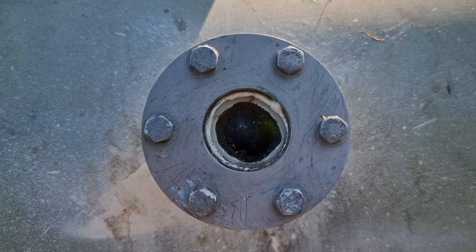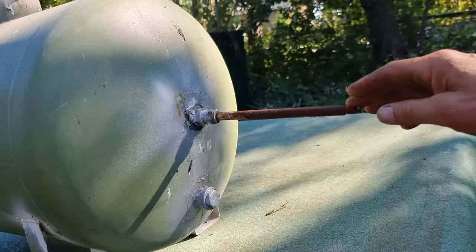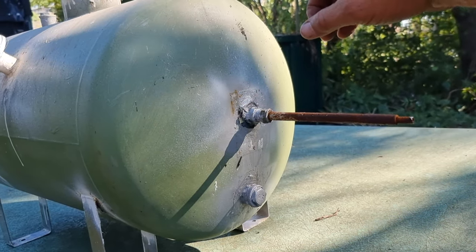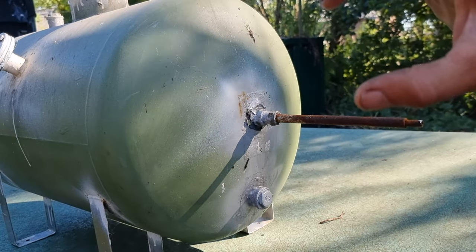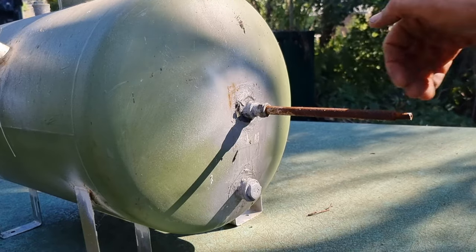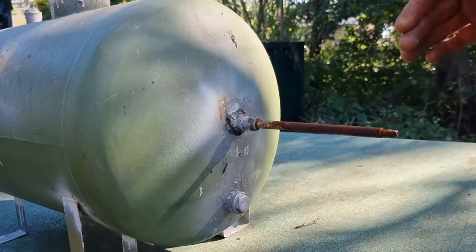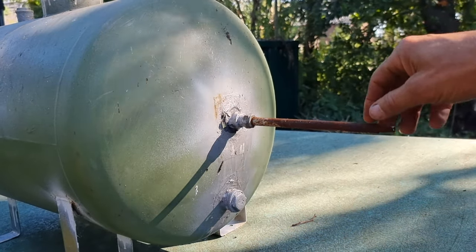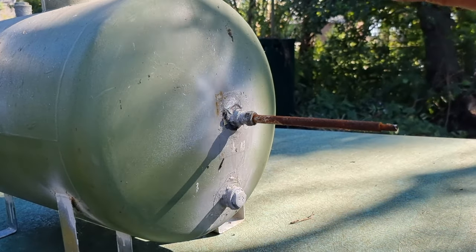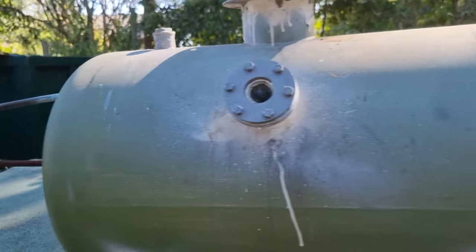I started with something also replicated from the Sapphire tank project — cathodes of this size, small brass plates. And I could adjust it. That was the first experience where I found I had to bring the cathode very close to the anode to start the process. So it's the voltage and the distance that makes the start of the process.